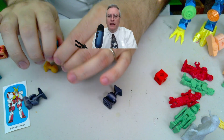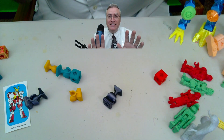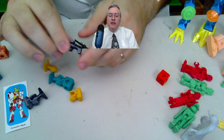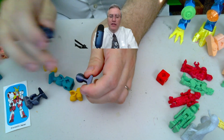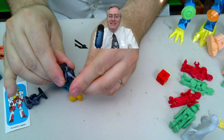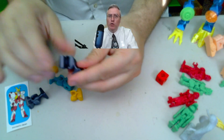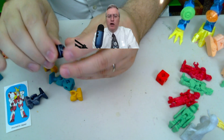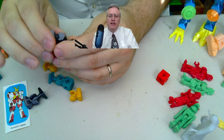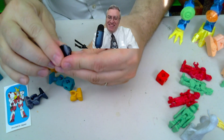So there's a possibility that this opens up that I've never had before, and that is negative tolerances. This ball joint is actually a millimeter bigger than the other ball joints in the design, which means it fits together a lot tighter, is a little bit harder to move, and holds its position a lot better. This is advanced Printer Block ball and sockets — it enables making things you could practically use for stop motion. It's that rugged, but this creates a bit of a problem for me.